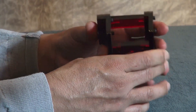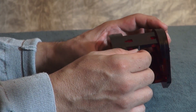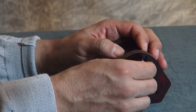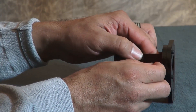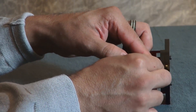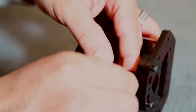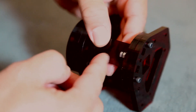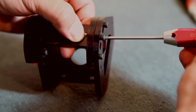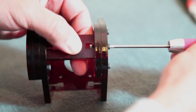Once you have the bracket pressed together, you need to put a nut in each square opening on the pieces one by one with an M3 x 16mm bolt. To make it a little easier, you can put two of the nuts together and slide them into the square hole — this is tricky but with a little patience you can get it in there. Now with your nuts in place, held by your finger in the back, put your M3 x 16mm bolt in. As soon as you start getting traction with the first nut, go ahead and let the other nut fall out and just compress fit. Don't over tighten.